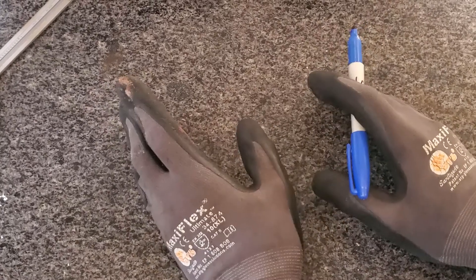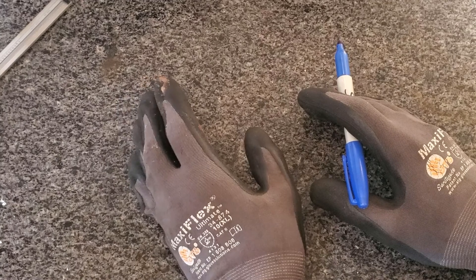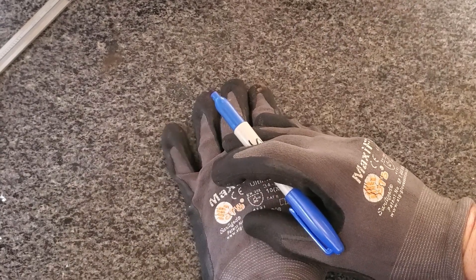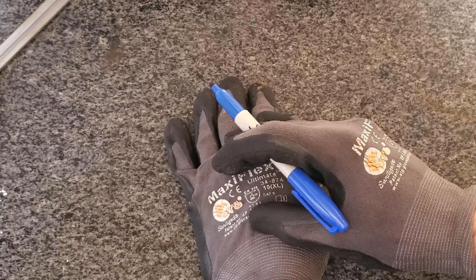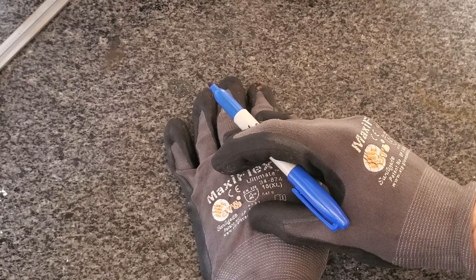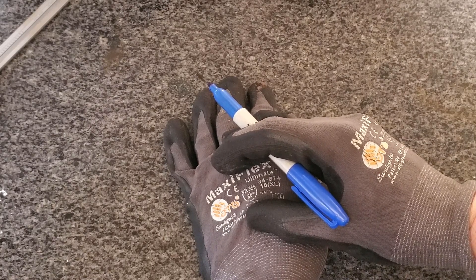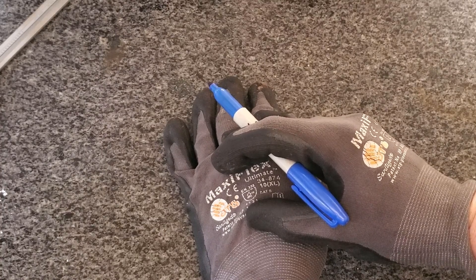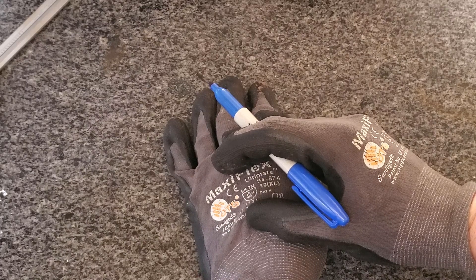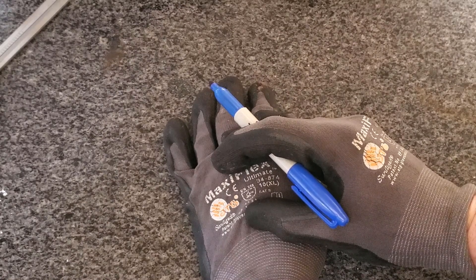I'm not going to machine all 64 of them myself, but I thought this was a good opportunity to test with the three quarter inch carbide roughing mill and a nice heavy cut — quarter inch deep — in somewhat difficult material, 304 stainless. You never see YouTubers demonstrating anything with 304; they demonstrate with aluminum or brass because it's quick and easy and goes like clockwork. So we'll take a nice heavy cut.